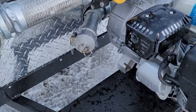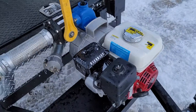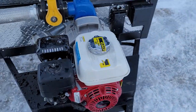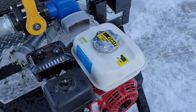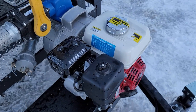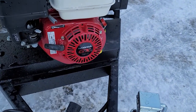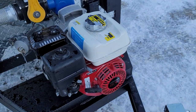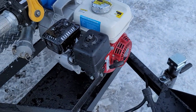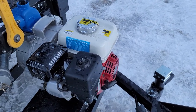Down underneath, that's the hookup point for your self-drafting system. The pump is a two-inch Gorman-Rupp IPT pump — it's actually manufactured by AMT Pumps, and that's who you would contact for any service parts. The motor is a Honda GX160, probably one of the most common motors on the market — parts are readily available and it's by far one of the most dependable motors out there.